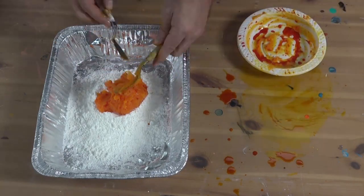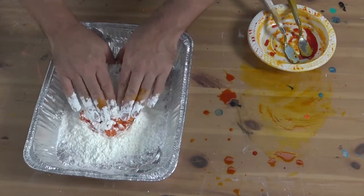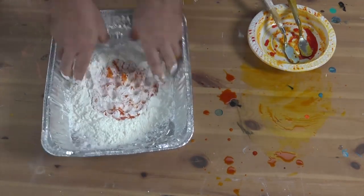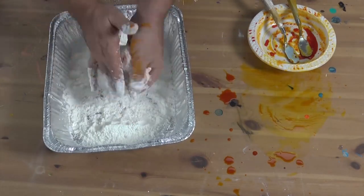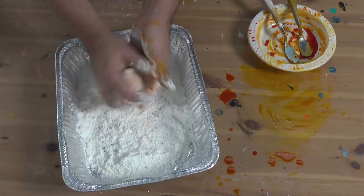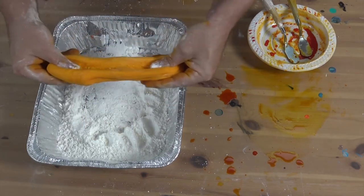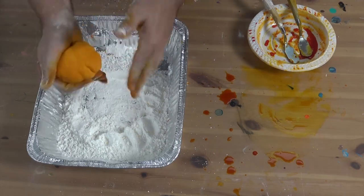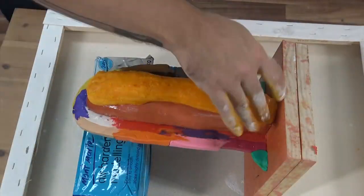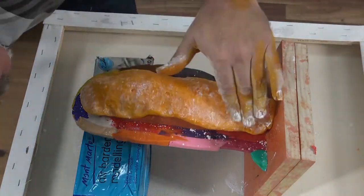Place your silicone into the corn flour and knead the mix until it becomes pliable, kind of like a pizza dough. If you don't want to get yellow hands, like I did, you can wear some latex gloves, although the yellow will wash off after a while. Knead the ball until the colour comes back, and if you find it's too sticky, coat it with more corn flour. Be careful though, too much corn flour will harden your silicone pretty quickly and it'll end up becoming unusable.